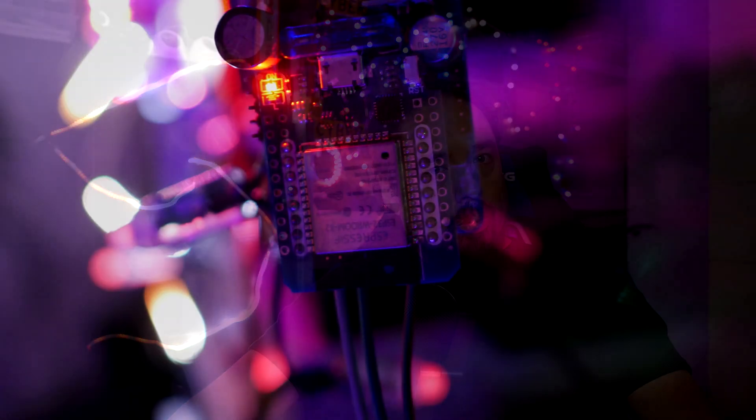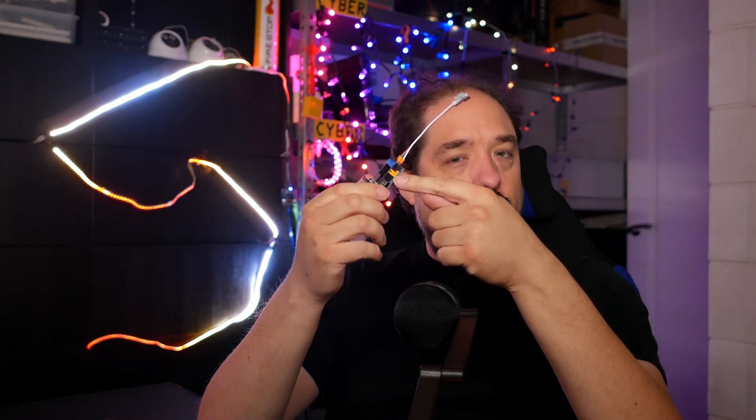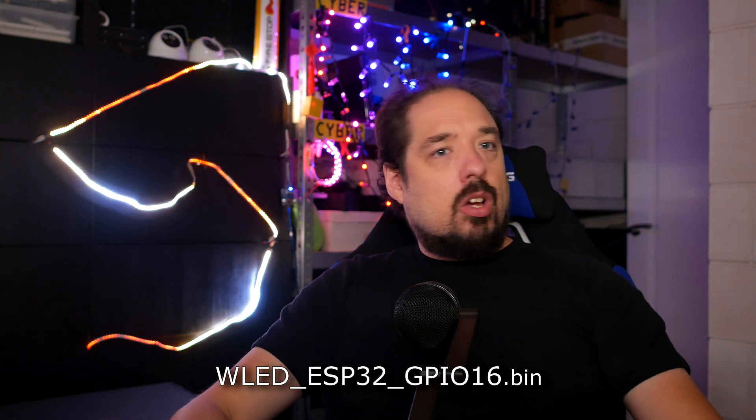As mentioned, I've been testing WLED with my current LED boards and it's been working perfectly. There is, however, a slight caveat if you wish to use the ESP32. The pre-compiled version of WLED uses the same GPIO pin as on the 8266, and that's GPIO2. But that doesn't really work on the ESP32 boards since the onboard LED is connected to GPIO2. I've made a very quick change in the code and then made a pre-compiled binary where I changed the pin to GPIO16, which is equivalent to the 2 position of the jumper on the QuinLED Dig Uno. I'll have a link to this pre-compiled binary in the description and on the quinled.info page, but that will quickly become an old version. I've talked to Aircookie and he's going to look into being able to change the pin you wish to use for the ESP32 easier than having to change it in the code and doing a manual recompile.